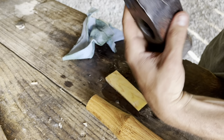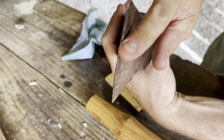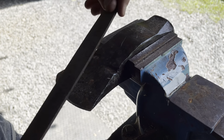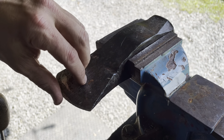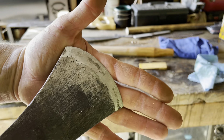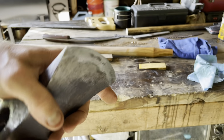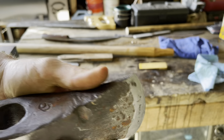I am going to sharpen it up just a little bit, because when you're splitting on the ground you try not to, but you're going to hit the dirt and hit some rocks — so that's about three or four years of abuse right there. Now you don't have to get very picky on the edge on a splitting maul; it just needs to be sharp enough to dig into the wood a bit and allow it to split efficiently. Now we have a very serviceable edge on our splitting maul — I got most of the major blemishes out of there from hitting rocks in the ground and things like that — and it is plenty sharp. It's actually probably sharper than it needs to be, but it will definitely get the job done.